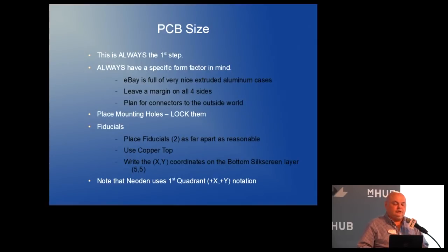Professionally, when making a new circuit design, you can't start PCB layout until the mechanical engineer says how big the board is, where the mounting holes go, and where the TO-220 part needing a heatsink screw goes. All that mechanical work has to come first. I see boards, particularly from students, where the mounting hole was the last thing they thought of. It should be number one.